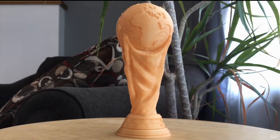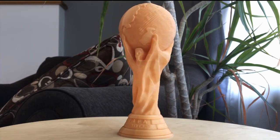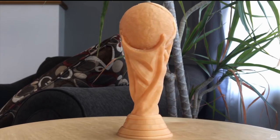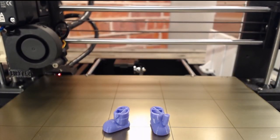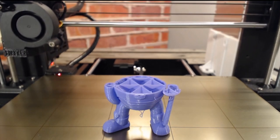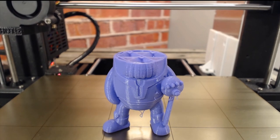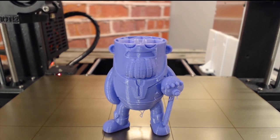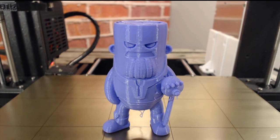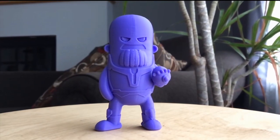You've got your printer and stuck your 3D file on a memory card with eager anticipation of owning a physical copy of that digital model — only to see nothing show up when you try to print it. This is because you first need to convert the model into a file called a gcode, which slices the model into individual lines of instructions that tell your printer how to make it. I like to use Cura as my slicer — it's free, quick to learn, and makes the whole process incredibly easy.